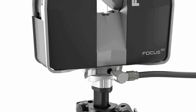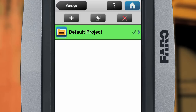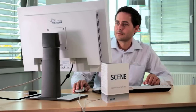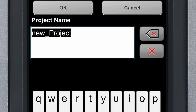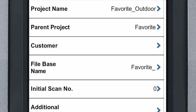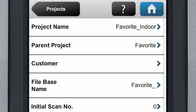Additional targets are necessary for our project. To maintain an overview of all the necessary scans, the project should be carefully structured. We recommend grouping associated files in project folders. This folder structure can be created directly on the scanner, but the more elegant variation is project preparation using the Scene program, which is also used for registering and analyzing the scan data later. Folder structures and base file names are defined in advance, distinguishing between exterior and interior scans, with further story-based subdivisions for the interior.